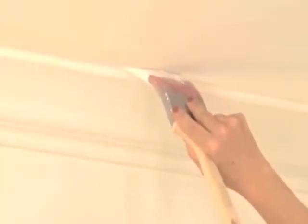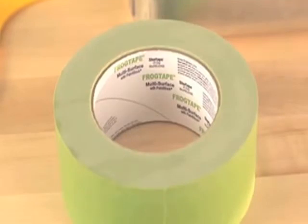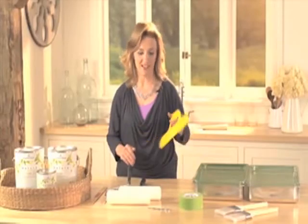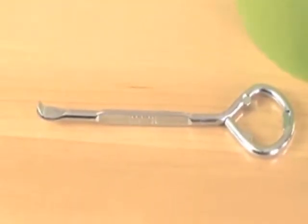Good quality painter's tape is ideal — you don't want to be removing fresh paint if you have a higher-tack or low-quality tape. An edger is a great idea if you don't want to use tape, to ensure a nice straight line. You'll also need a paint can opener, and of course a tray and tray liners. Getting a few tray liners will save you from having to clean out your tray between different color applications.